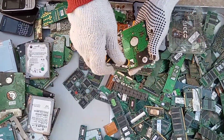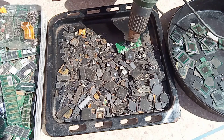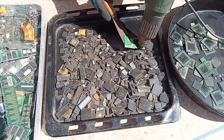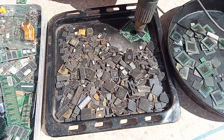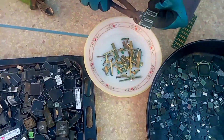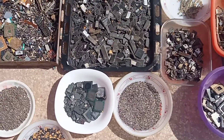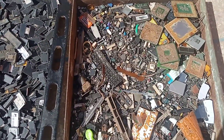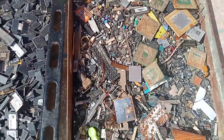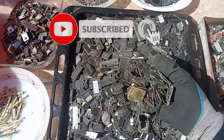Pre-separation treatment of e-waste. The processing of e-waste typically begins with a manually intensive dismantling phase, during which circuit board components and the lithium battery are removed for recycling elsewhere. The printed circuit boards are subsequently graded according to their metal-to-plastic ratio and shredded, typically into 1.0 square centimeter pieces. The shredded printed circuit boards need to be separated into metallic, ferrous and non-ferrous, and non-metallic polymer and ceramic components.